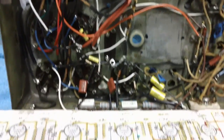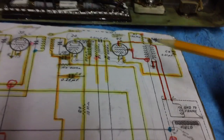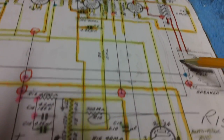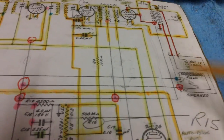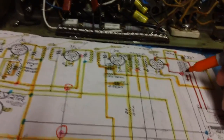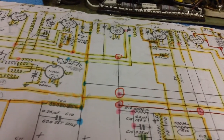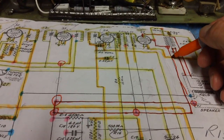We've got all the contact points done for this segment. What we've done is connected pin 4 on the 47 tube — that pin 4 comes down, comes across, comes up, and goes over and connects to that speaker. All that wire just to go from here down to here. We are connected to the speaker plug, so let's go ahead and color that in so we don't get confused.